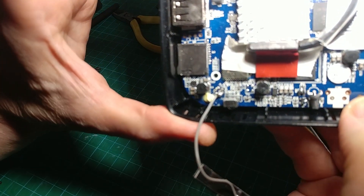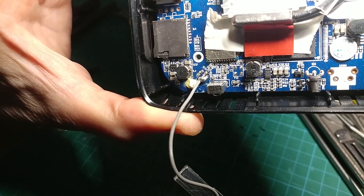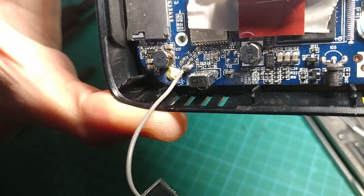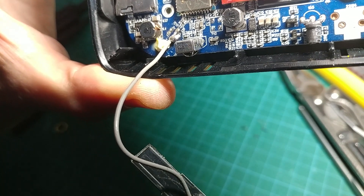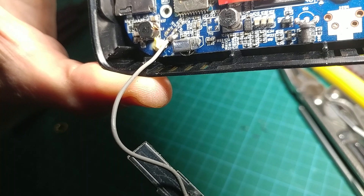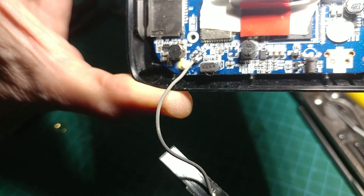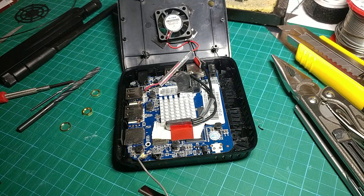If I get in close and focus in there — you can see the central core goes up at 45 degrees, and the screen is soldered in a great big blob to the right of it. Basically that's exactly the same with the wire you're going to strip: there'll be fine screen wires and a central core. You solder the center core to that little tiny spot and the screen to the other bit. The pads look like the manufacturer actually designed the board to have a plug and socket arrangement but then didn't bother fitting the socket — probably saved them tuppence.